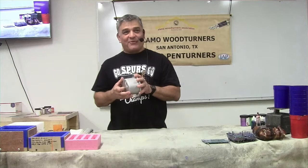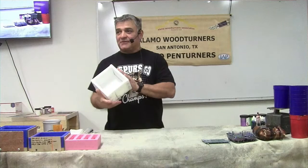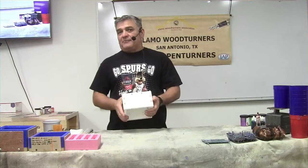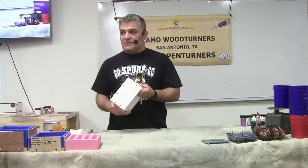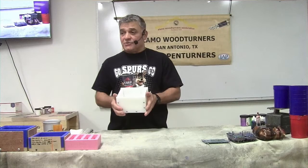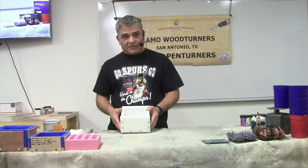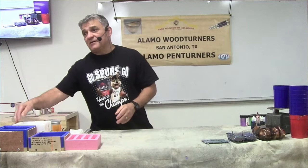High-density polyethylene cutting block material works just fine. The resin will pop out the first 10-12 times, but after that the coating starts wearing away and it gets a little rough. I always use release even when they're brand new - it extends the life of the mold. I use these constantly, so it's not a one-time use and toss.